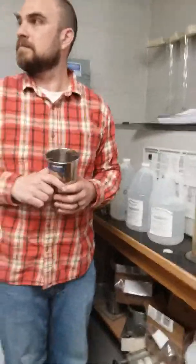Mix up and down, back and forth, 1 minute, put back in, and then we're going to start taking our readings. The big thing when we take our readings is we put this in 25 to 30 seconds before we want a reading. After every reading, we put that in and spin it. A big thing: don't drop it in. We can also check our water temperature right after each reading by placing it into our material, just to monitor that we're at 20.